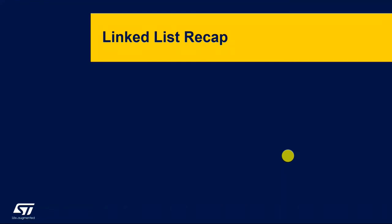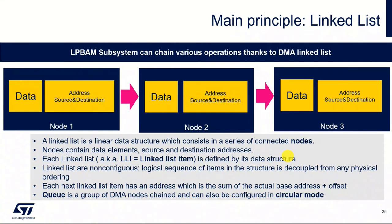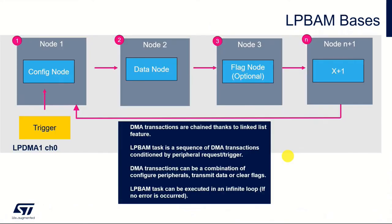This is intended just to recap what we did this morning for the GPDMA section and linked list section. We can use the DMA block in linked list mode, which means chaining together individual configuration nodes. We can have a configuration to handle the DMA block in a certain way, then reload it to point to a different peripheral or different area of memory. We store those configurations as nodes and link them together using a linked list. When running in circular mode, you essentially loop from the last node back to the first node.